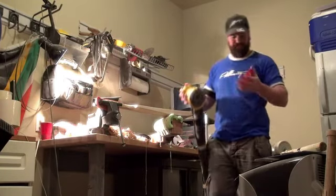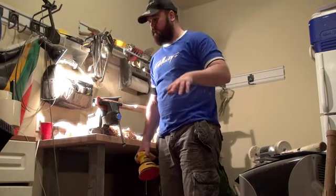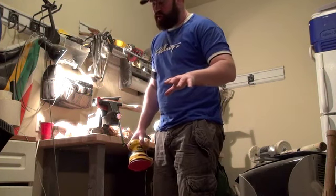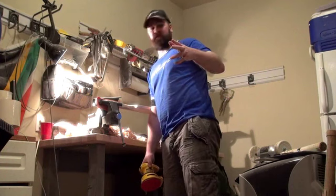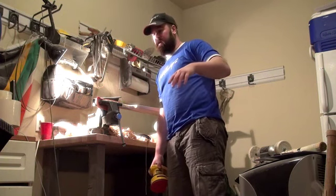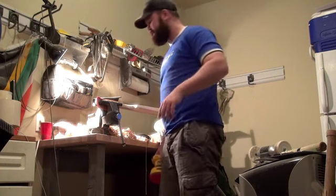So after 120, we come down again, this time onto 220, and this will really be the point of where we see any imperfections that need attention. If we've done a fairly good job the first time round, I'm not expecting we have kind of rushed through this a little bit, then we should be home and hosed, because the next couple of sanding points really are just fairly clean. You just cut over the top with what we'll be using is probably a 320 and probably a 400, but the 400 will be finished by hand.